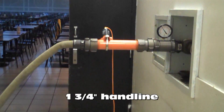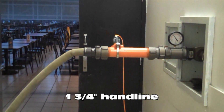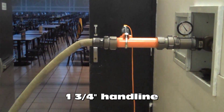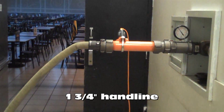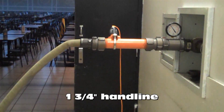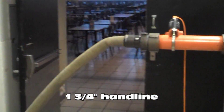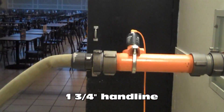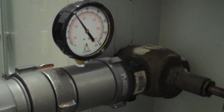September 13th, 2009, Miami Township Fire Department, Montgomery County, conducting standpipe flow tests. We are currently hooked up with an inch and three-quarter line, 150 feet to a fog nozzle that goes to the exterior. We are on one of the risers near the food court.